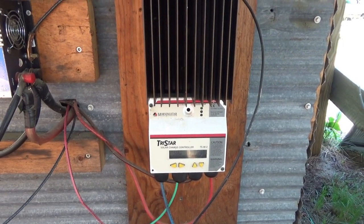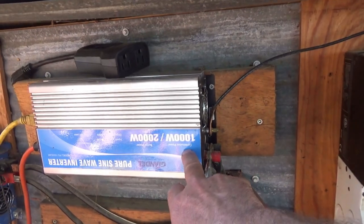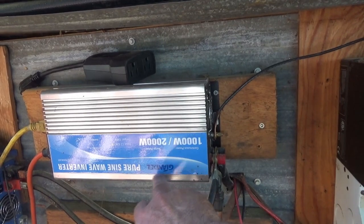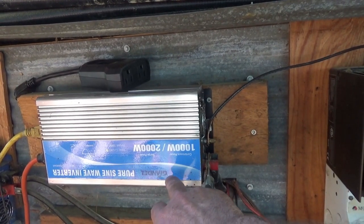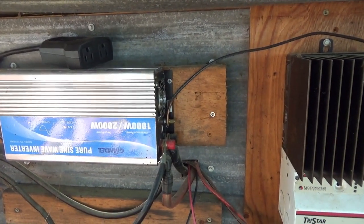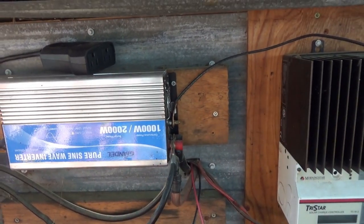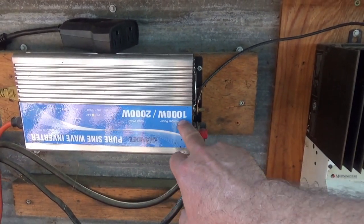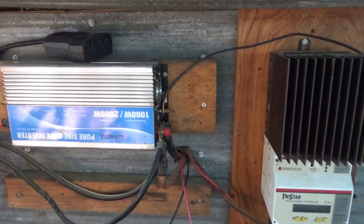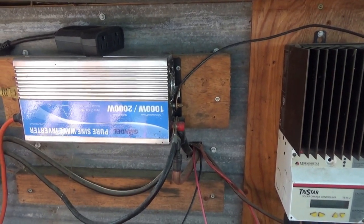As I said in a previous video, we are going to go fully off the grid again — 100% fully off the grid once more. I only have a 1000-watt pure sine wave inverter from G&L, which has been serving me well for years — I'll put the link down below. My only limitation right now is that I have 1600 to 1800 watts of solar but only 1000 watts continuous power output on the inverter, so I'm going to have to get another one eventually.